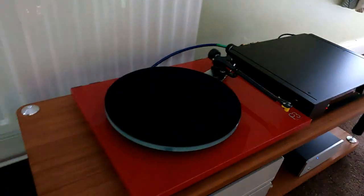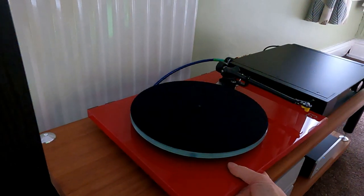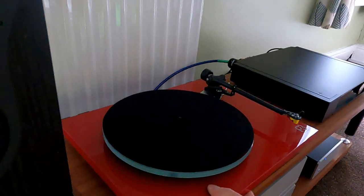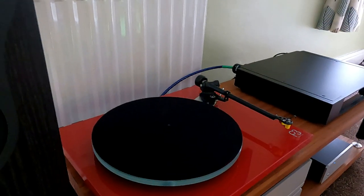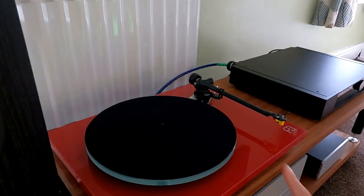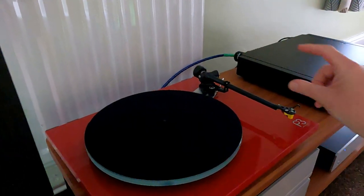And a simple thing with this, if I can do this without falling over, if I move the deck away, we can still hear a bit of background hiss, because the phono stages do have a bit of background hiss, but the hum is pretty much gone. And I've moved the deck by that much.